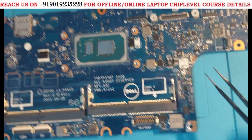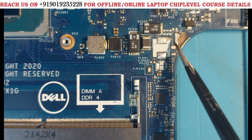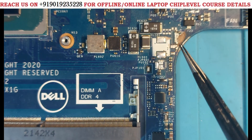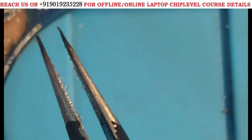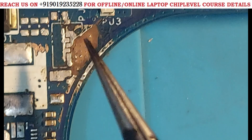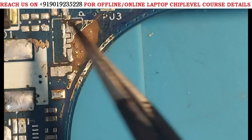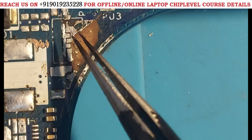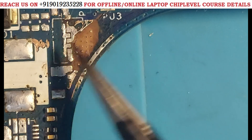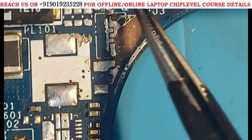Here also there is one more jumper which I marked. I'll explain why I marked that too. When we disconnect this, there was short here and here also. When we disconnect at least one side, the short should go, but then also we are getting 35 beep — meaning it's an impedance. In that case, I removed this one and the short on that section was gone.